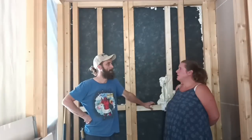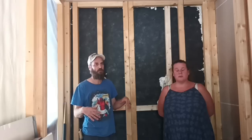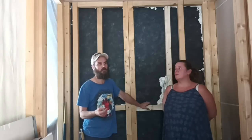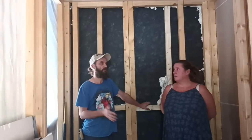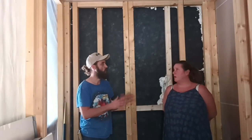What's the reasoning for double gypsum? Well, for our case, it's just to maintain the moisture a bit in the bathroom. But they also take moisture better because they're harder pressed, I think. So they take moisture a bit better than the normal sheets. And we're safeguarding ourselves for the future, if you want to have heavier tiles, we have two layers of gypsum that can take up the weight of the tiles.